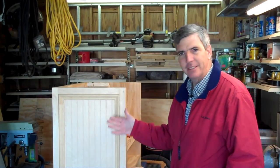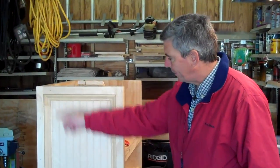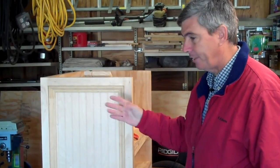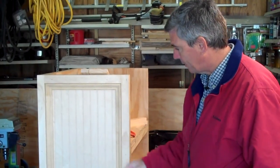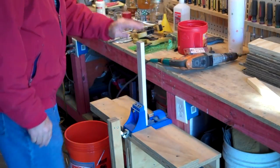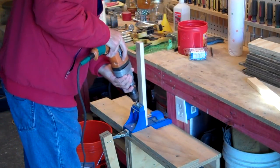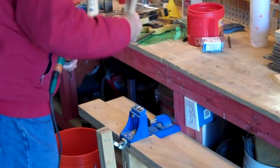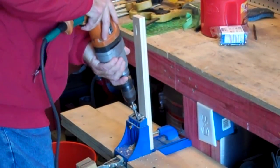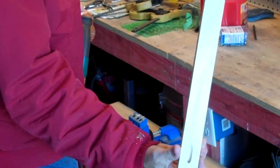To dress up the outside of the box — this isn't necessary, if you just want to go straight to painting you could — but we're going to make this frame, and there are many different ways to make it. If you want to just shoot the boards up against each other you can. I'm going to use a Kreg jig to make the frame. Just center your hole and you end up with something like that.